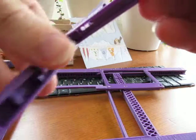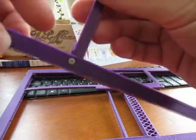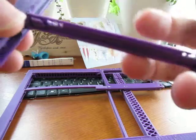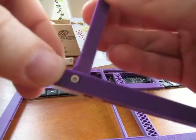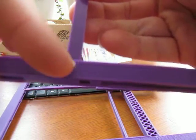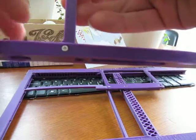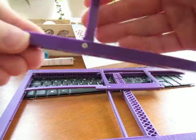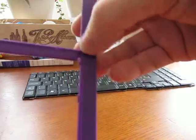This is the most recent modification. You can see this is the left-hand edge and I've had to put a screw hole in here — there's a small hole in this piece, on a rectangular part that goes into a slot here. This is one of the few places in the main construction where the lines go along the 3D plastic, so this comes in from the side, but fortunately all of the pull is going to be on there. This basically stops this part from bending outwards, which would cause the bamboo panels slotted in here to fall out, and the keyboard would also drop out.